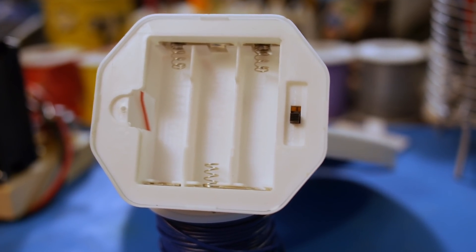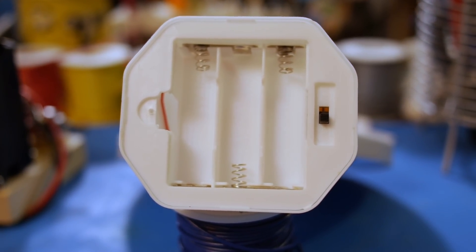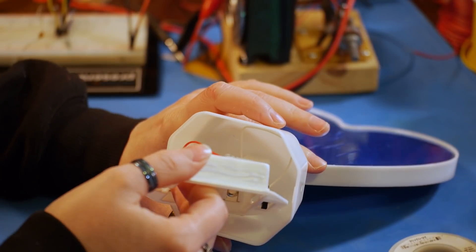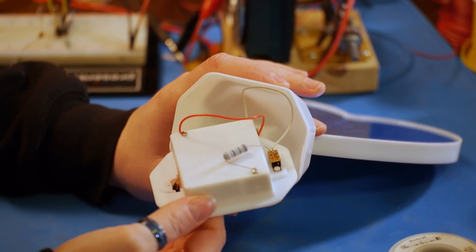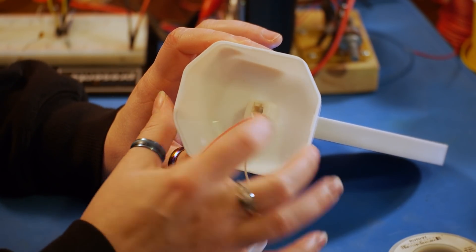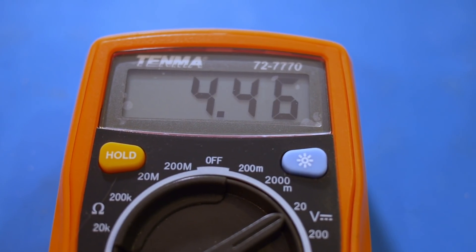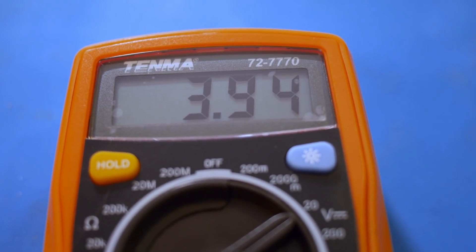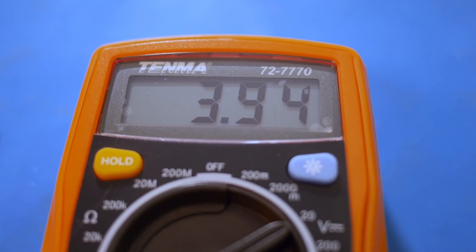The heart has a built-in 4.5 volt battery compartment and a handy power switch. If I open this up, there's already a current limiting resistor in here for the LEDs — I'll just use that instead of adding my own, but since it's between the switch and the battery pack, I'll need to move it to the perfboard. The 555 timer can run off of 4.5 volts, but the 555 output voltage is a little bit less, closer to 4 volts. That should still be plenty to power the LEDs, so no problem there. Time to solder it up!